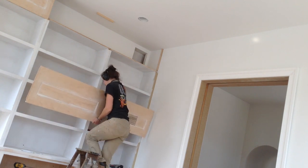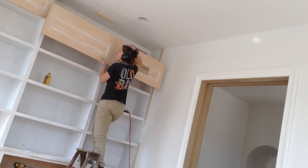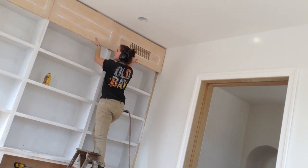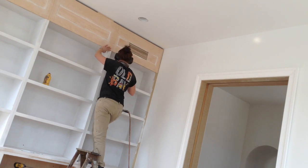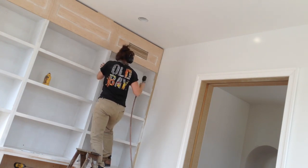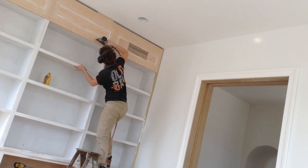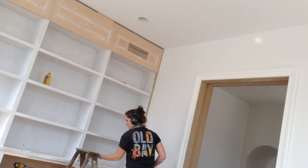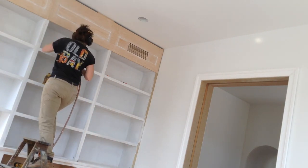To add the top: the studs in the ceiling — I put these little spacers on so I had something to attach to the ceiling, some spacers on the wall, and I have my little piece of wood in there. Then this just popped right into place — I was really happy with how this went up. I could attach it with brads all around the tops and the bottoms, and those pieces in the wall and the ceiling are sunk into studs, so they'll hold pretty well.